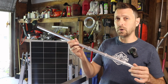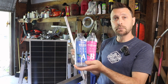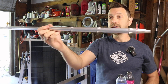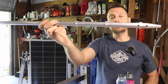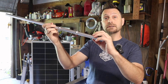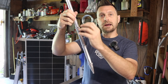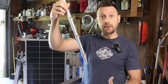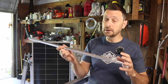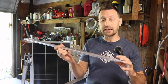You might say that's not really going to hold anything, but what's unique about these is it comes with a two-part mixable epoxy resin. That goes down the tube of the ground spike and leaks out all of these holes and also out the bottom. What that's going to do in your soil is create resin roots. They tested the pullout on this and it's about a thousand pounds — that's a really cool way to anchor this with a lot of strength.